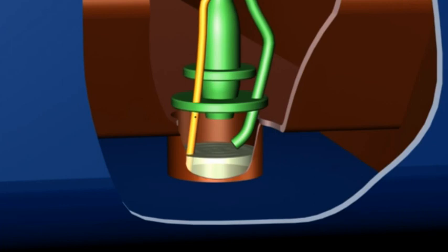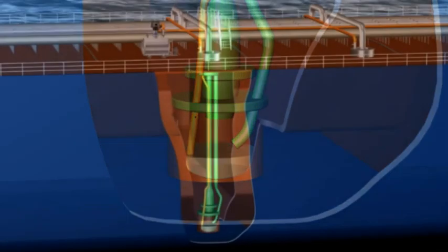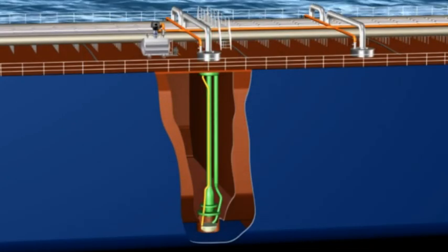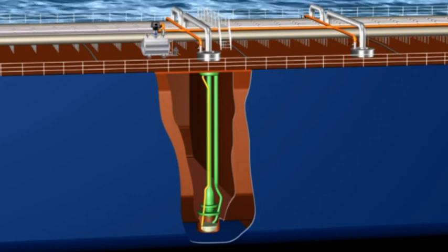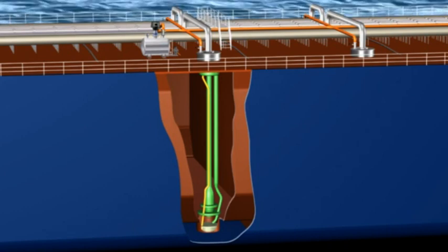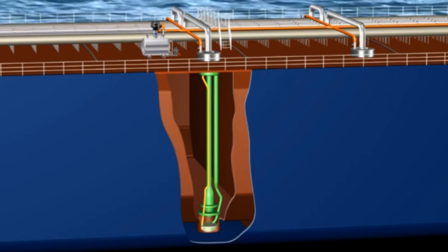On this additional stripping pipe there is a need for a false air inlet hole just above the liquid level. A separate pipeline is needed on deck, distributed to each cargo tank and connected to the additional pipeline. The pipeline on deck is also connected to the inlet of the AB950EX unit.